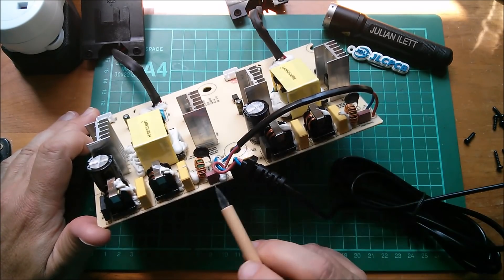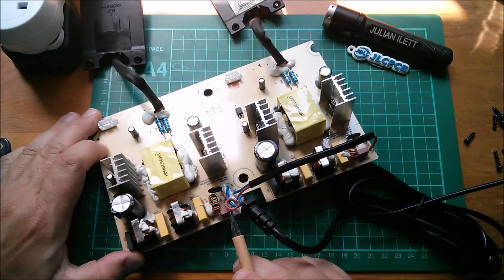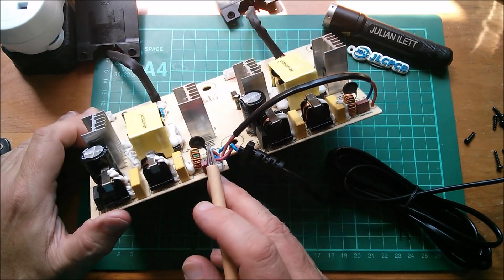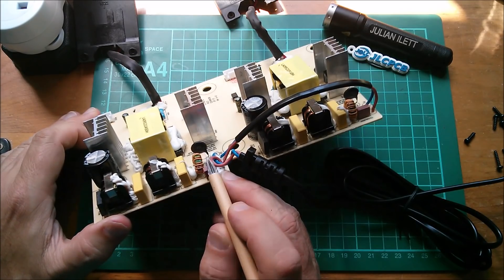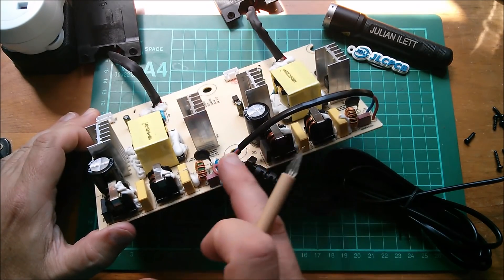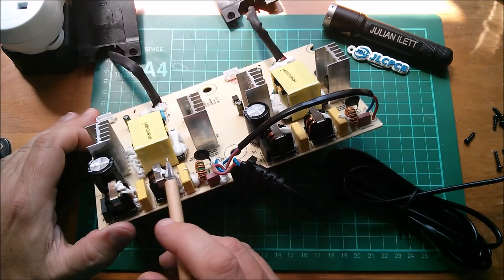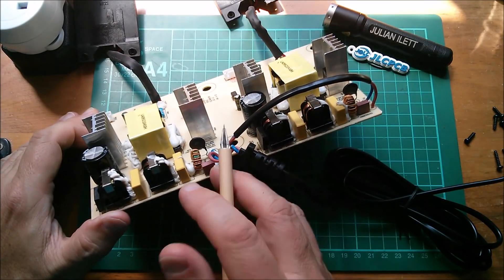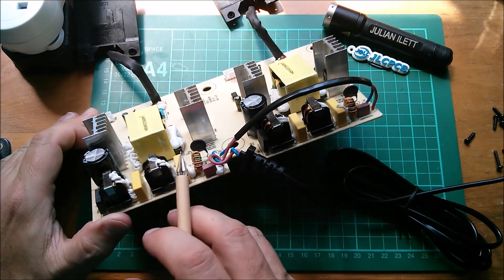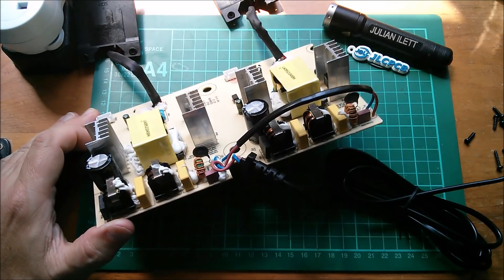These are identical circuits — the same set of components on each one, no common components at all. Each circuit has its own fuse — that's 3.15 amps I think — and also an NTC thermistor used as an inrush current limiter. This one is a 2.5D11, and I'm pretty sure the 2.5 refers to ohms when cold. That's what allows low current to flow through the circuit into the big capacitor. The 2.5 ohm resistance makes that a slower process; as it warms up it goes to something near zero ohms — almost like a wire short — but by that time the capacitor is mostly charged and the inrush event is over.